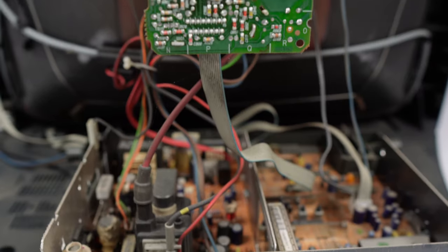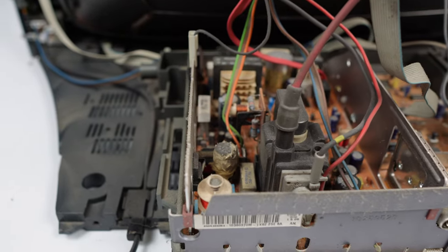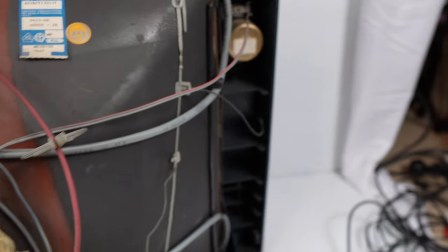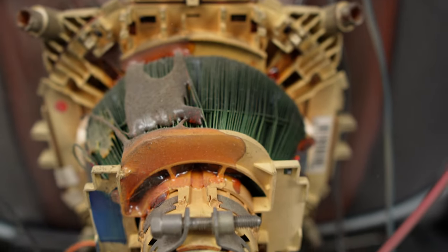Small neck board. There's our chassis — the TX92. That's what all the fuss is about. Fairly small chassis. Speaker on the left, speaker on the right. And the yoke is green in colour — often the case with Thompson. You sometimes see these Video Color tubes in arcade machines as well.